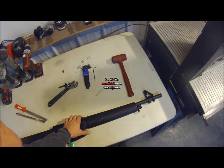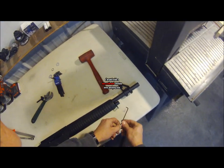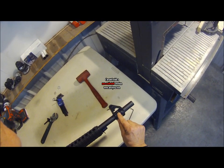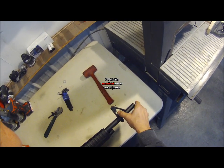First off, you get a 3mm Allen wrench and take out these two bolts that hold the front side on right here. It's also probably a good idea to loosen this set screw up here so you don't scratch the barrel as this slides off.